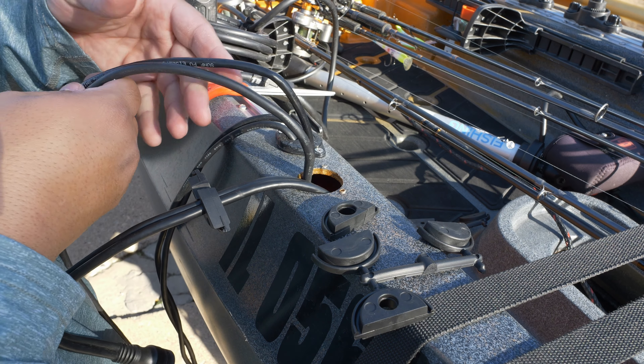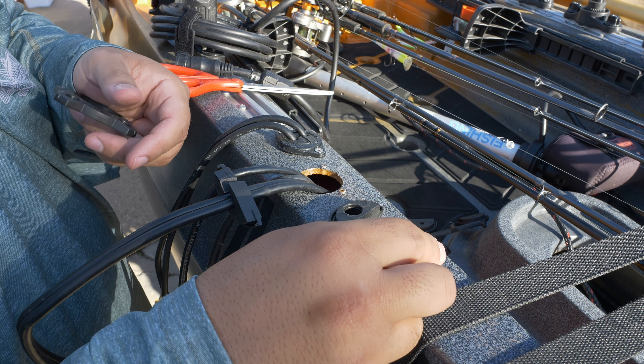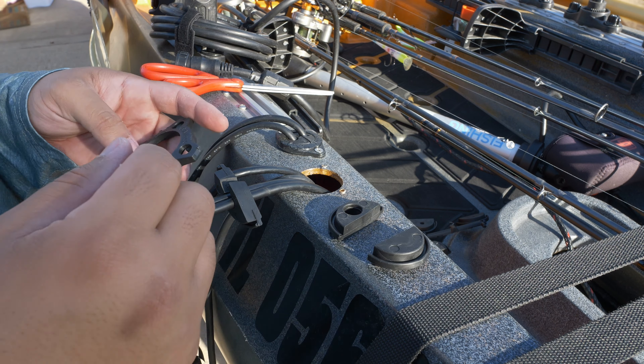The other thing I have here is two more cables coming out. The way these are designed, the components go underneath like this, and you put the other side on — that's how it seats itself. You can tell it's really designed for two cables. However, because I have three, I'm going to have to figure this out. I might find the same size hole and jam these two in there, and that's going to work for me. This is going to be your choice on whether you're comfortable with that. I personally am comfortable with it — I'm not going to have issues with taking water right here, and if the kayak flips, water will get in there and we'll deal with it accordingly.